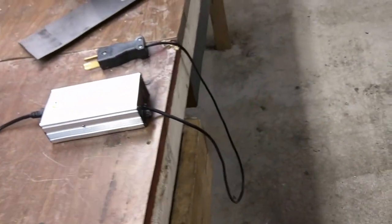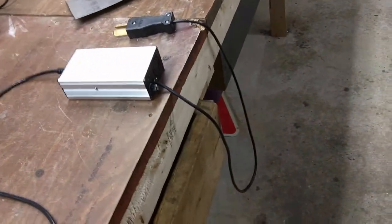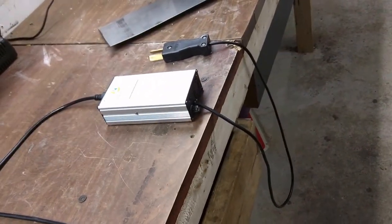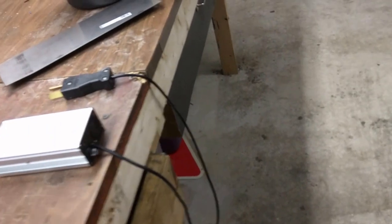Without a BMS, you're assuming all of your cells are balanced to 4.2 each, or whatever the peak voltage will be across all of your cells. You could end up with vast differences between cells if you don't balance charge this, especially with the way I am not going through the BMS when driving it. So the BMS just maintains and balances when I am charging.